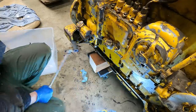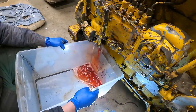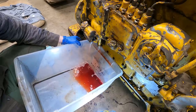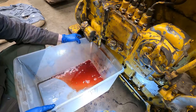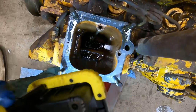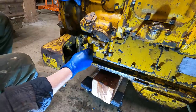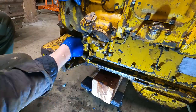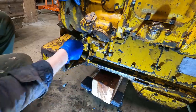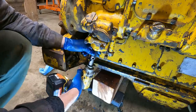I have no idea how long this engine's been sitting — it could have been anywhere from one year to 30 years. The diesel doesn't look too bad but it doesn't smell like diesel — that's probably not a good sign. There's some sludge in there. I'm going to take the transfer pump off because there was so much gross gel and not all of it washed out. There's a bunch of crap on the bottom. There's definitely been water on the bottom of here, as you'd expect since it's been sitting so long. Better safe than sorry.